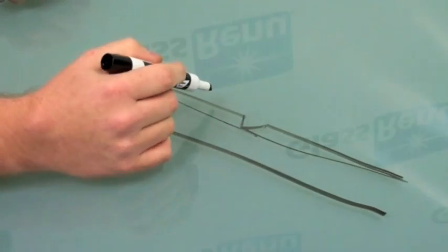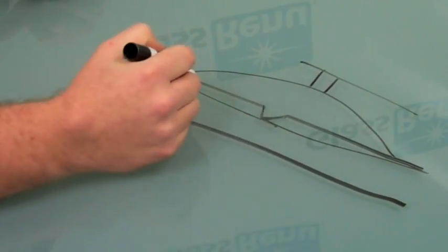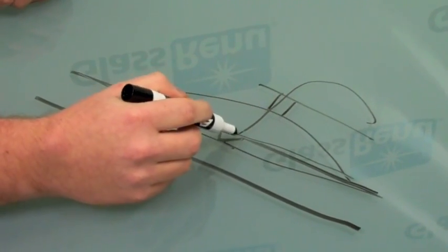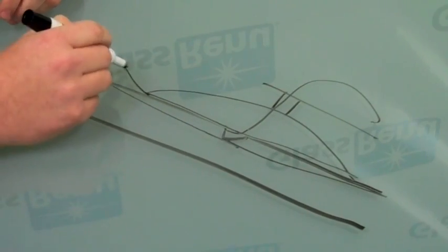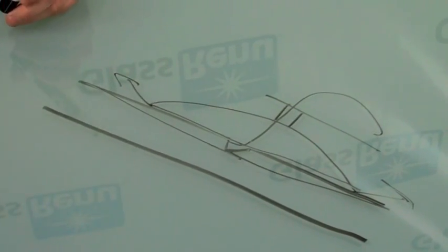The wet method creates lensing. I'm sure everyone who's seen this video at some point or another has come across a piece of glass that someone tried scratch removal on, and they noticed that there was kind of a funhouse mirror effect where the damage used to be. What happened is that when they were trying to take that damage out using water, here's the pad they were using on whatever grinder they were using, as the water flows through the pad onto the surface of the glass, two things end up happening. Number one, you get a big mess as the water is ejected all over the place, and two, the glass ends up distorted.